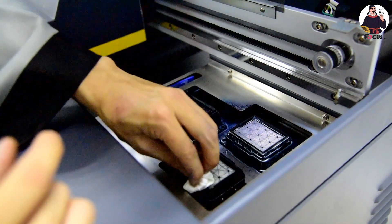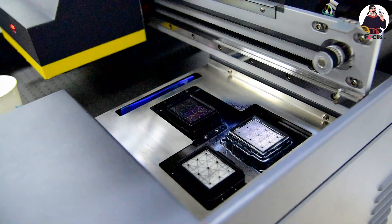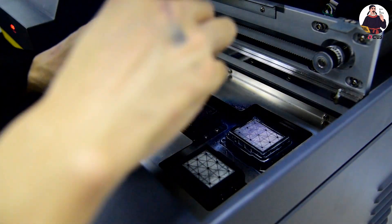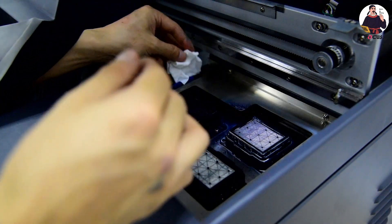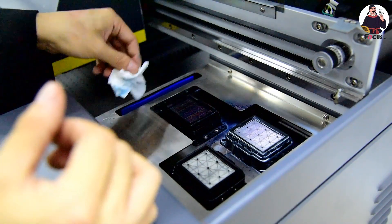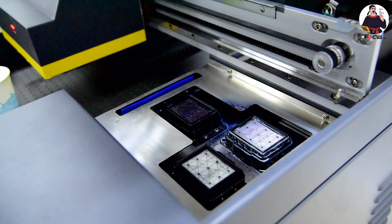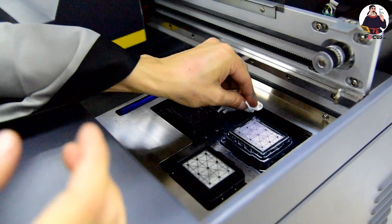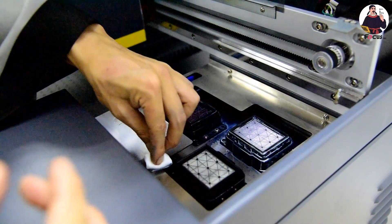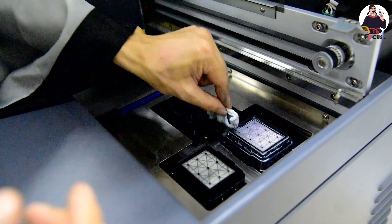The varnish cap station should also be cleaned. Apply some alcohol and clean the cap station as well, until it looks brand new. Then clean the waste ink at the panel and the bottom of the flushing dish — also as brand new.